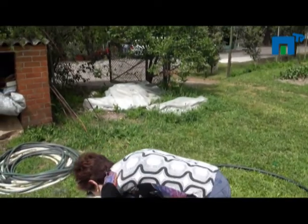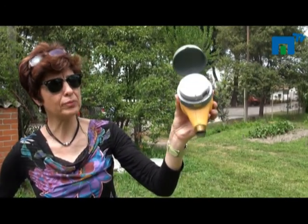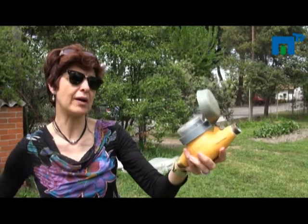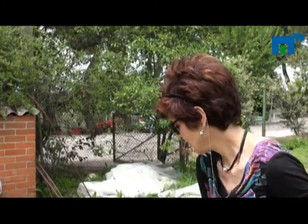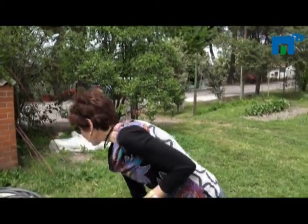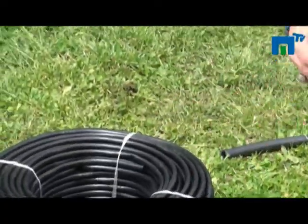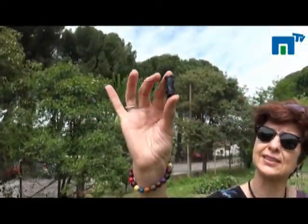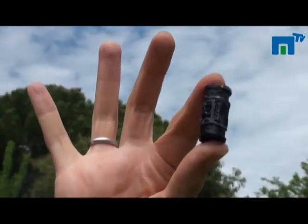Finally, we need a volume meter — a water volume meter. It can be used for programming the irrigation or simply to track the water bill. For this irrigation system, we have chosen an integrated non-pressure-compensating model at 2.2 liters per hour, and this is the design of the emitter that goes inside the pipe.